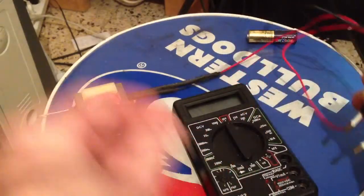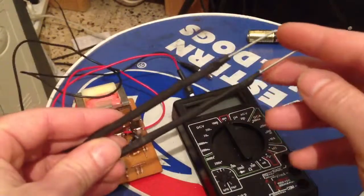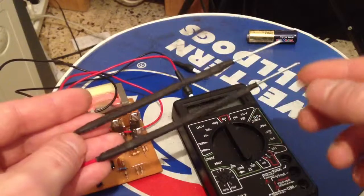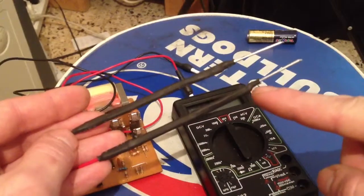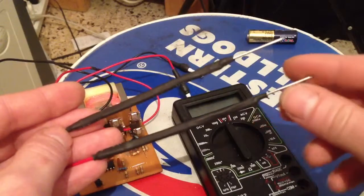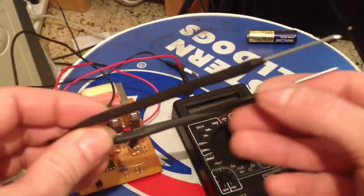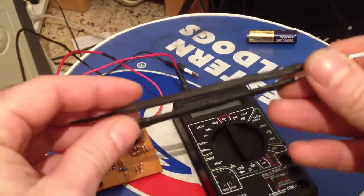I'm not going to try and rip it apart, but it is strong — believe me, take my word. The second part is the two tester edges, which are basically long thin rods. I used a thick paper clip I had laying around. I put the wire all the way up on the rod, then took the edge of the wire, wrapped it around and soldered it to the rod, leaving a tester edge, and then put heat shrinking sleeves on there to make it even sturdier — so it's pretty sturdy for testing.